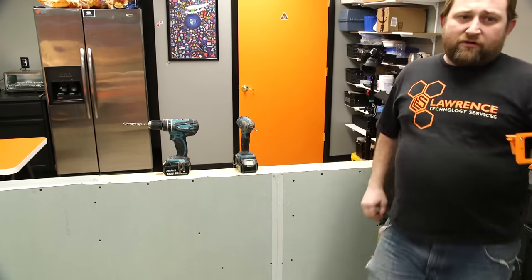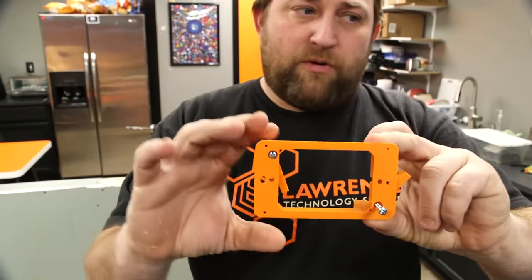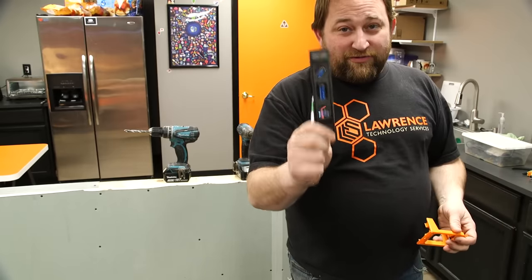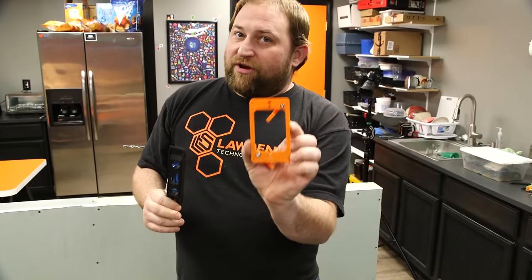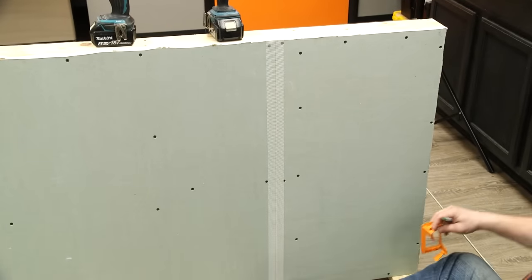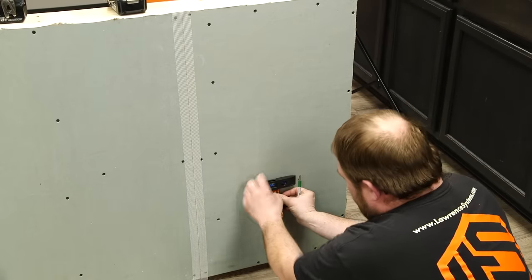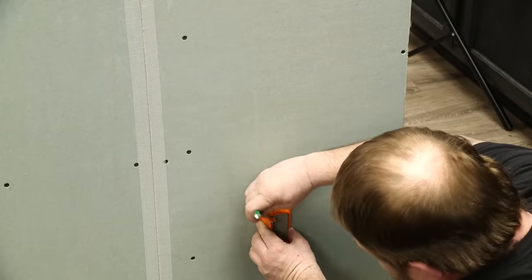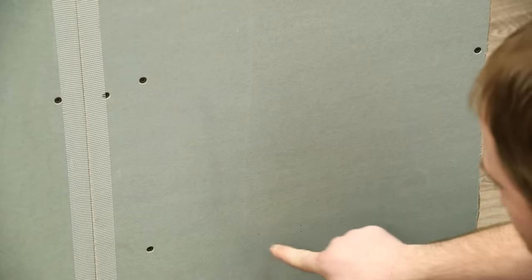Our next step is to take your Carlin mud ring. The mud ring has four little dots on it, and these four points are for simple marking purposes only. I'm going to take an ink pen — and we always use a level for these. It's very important that you don't make this crooked, because if you do, you can never get your wall plate to sit right; it'll always look funny. So we come into our first cavity and place the mud ring approximately where it's going to sit. I put the bubble level right on the top and get it leveled out. Now we make our four marks — just stick your ink pen right into those little dot holes. One, two, three, and four.